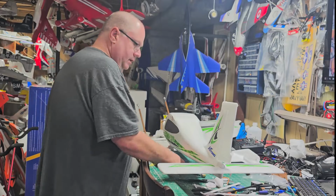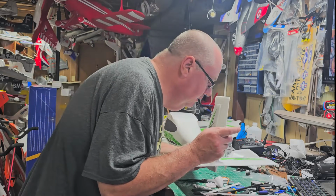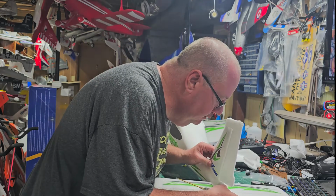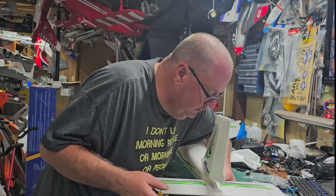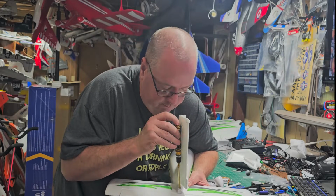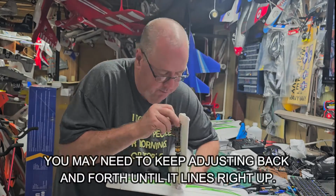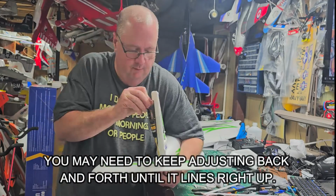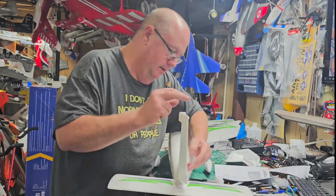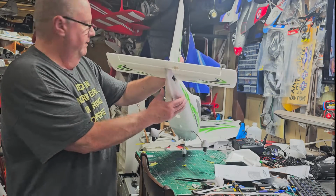Okay. And that's why you expose that hole. Put in your 2mm hex drive, support the underside, and you can kind of see the hole line up there. Yeah, you'll see it, it's obvious. It should drop right into place. Bottoming out point. Okay, now you can take that servo arm and push it back with your thumb. All right, now that takes care of that.